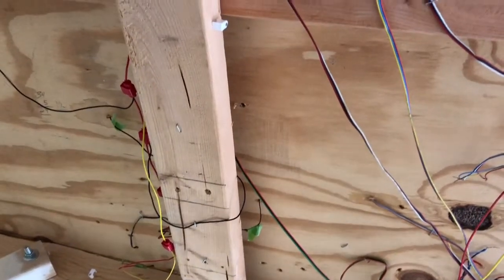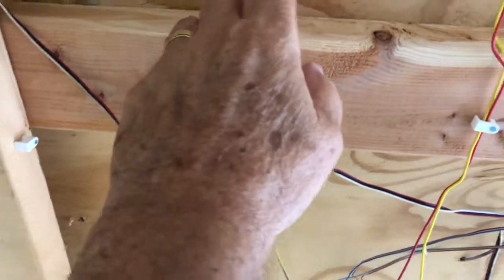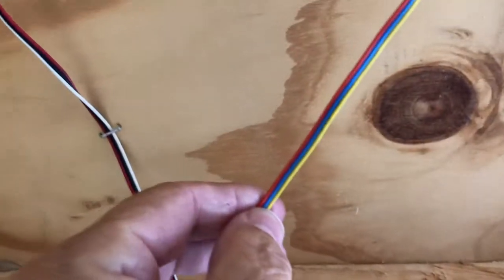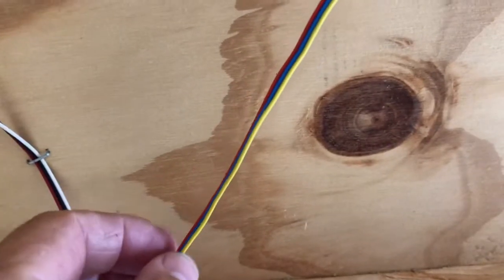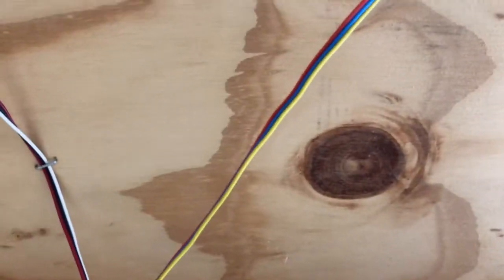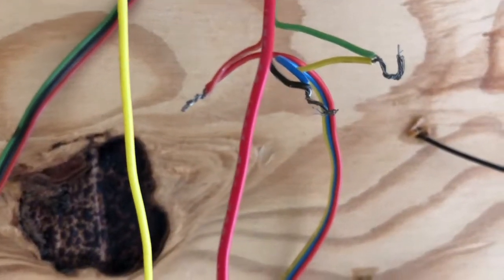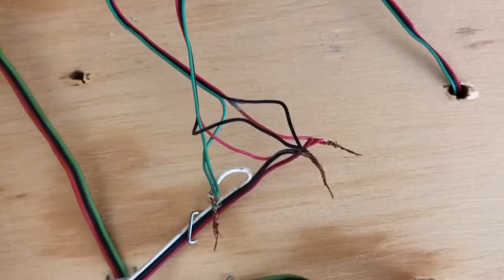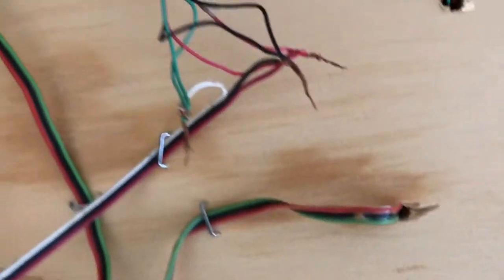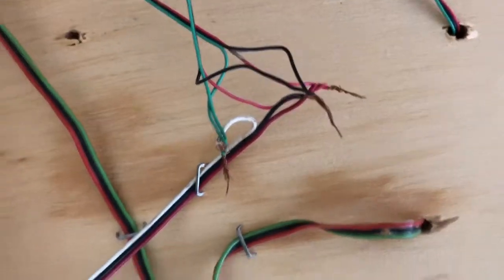So what I have here is these three colored wires are all the Atlas snap switches, and I used a lot of old wiring, so I just kind of twisted them together. Sometimes I have two switches, like when I switch from track A to track B, I've got two switches wired together so they both flip at the same time.